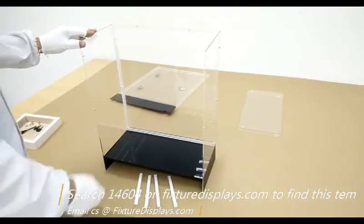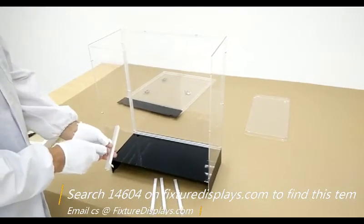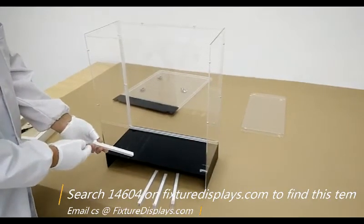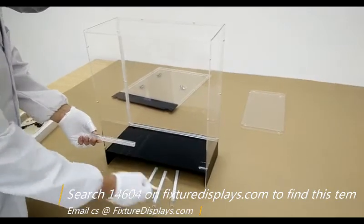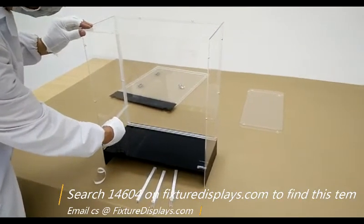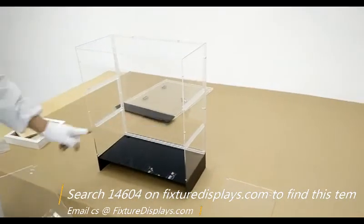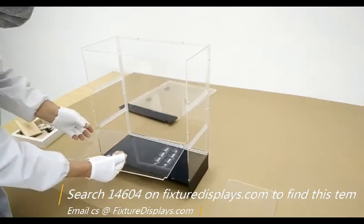When we come to the door panel, the lock is already pre-installed in this video, but in reality you will need to install the lock yourself — it's fairly straightforward. The shelves are regulated by strips that come with adhesive backing already in place. Simply peel off, measure carefully — I cannot stress enough, measure carefully — where you want to lay this strip. Make a mark using a pencil or paper to ensure the strip is positioned in your desired location.